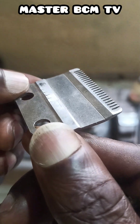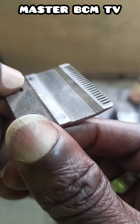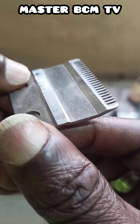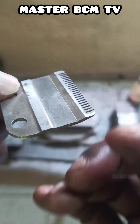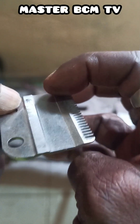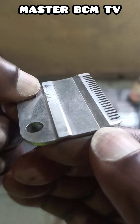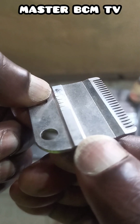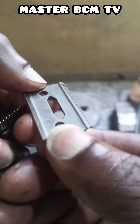It has been used. You can see the inner surface here — where you see the small blade surface, that place is dark, the place is worn down. Where you see the stainless in the form of a U-shape with the bigger blade, the down part of the small blades joins with the bottom of the thicker blade. That area is worn, which means this clipper blade cannot work fine or cut hair perfectly.